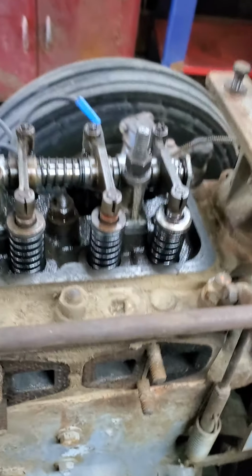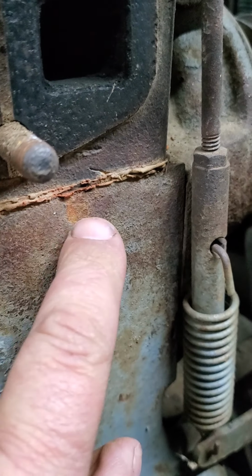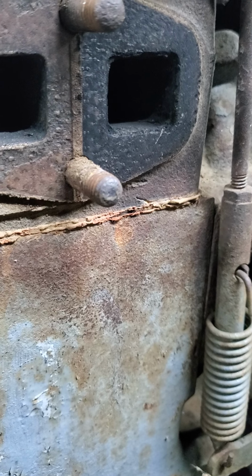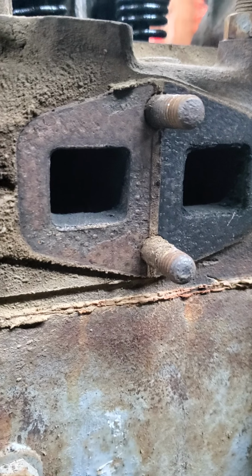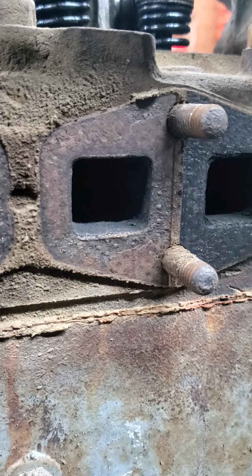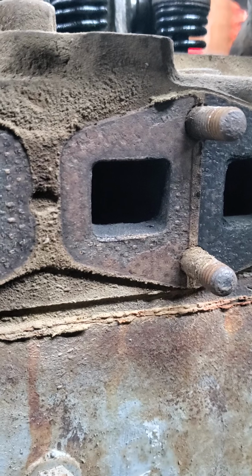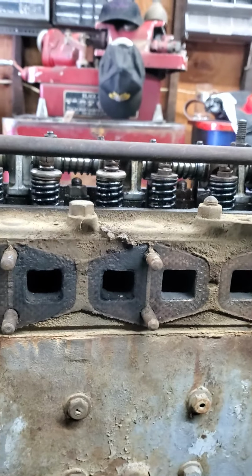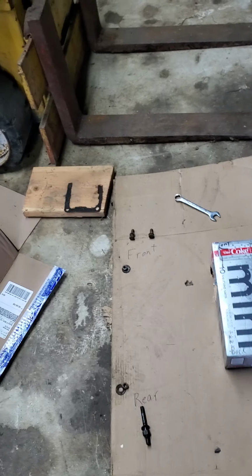head off. One thing that we did find with the head gasket when we just started looking at it, something that you don't normally see, but at the seam where the head gasket is, there is orange RTV gasket maker that is not normally used on head gaskets, so that was kind of cause for concern. Makes you believe that someone may have taken this apart before? Yeah, someone had definitely taken this apart before and either tried to reuse a gasket or something like that. That might actually be our problem. So hopefully we can find something that's pretty simple and pretty cost effective to fix.